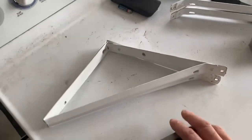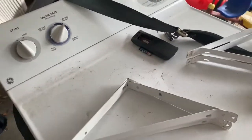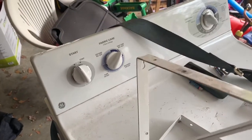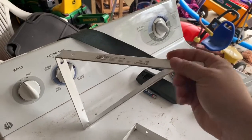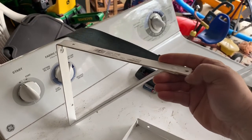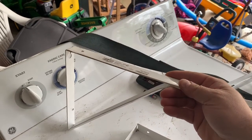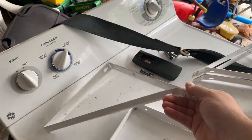Measurements so far: I've got about 27 inches, up to 34-35 inches to go across the bathroom shelf. I have as much room as I need height-wise. The brackets we're going to use - you can buy these at Home Depot - are about 10 inches long, but I'm going to plan for 11 inches. So I need a piece of wood that is at least 27 inches long and 11 inches wide, probably a half-inch thick.